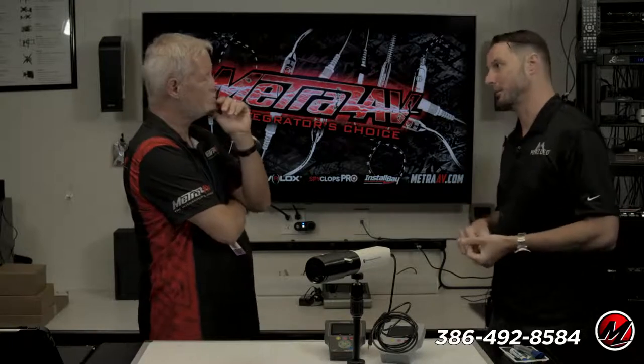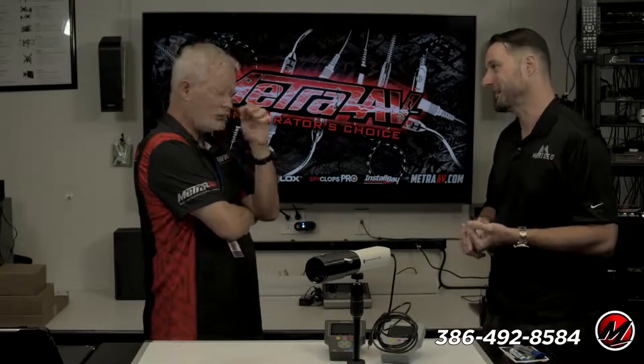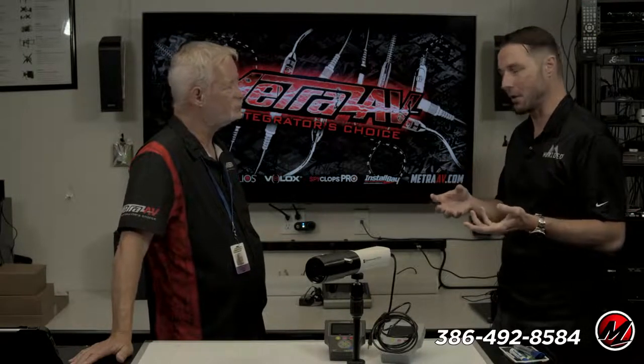So then somebody like me comes in, and we turn off the Energy Star, we turn off the horrible motion processing, we turn off the ambient light sensors. So now we're getting a more accurate picture, and it's brighter and more dynamic, whereas before, it'd be really bright and we would detune it down. So we're living in a little bit different world now where I'll go calibrate for somebody and the difference is so huge, especially if they were in the factory picture mode, they go, holy crap. So this whole idea of, oh, it's not as bright as it used to be after it was calibrated, that stuff has been out the window now for a few years.